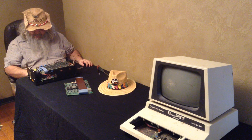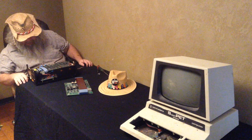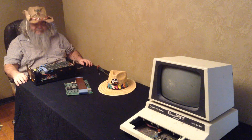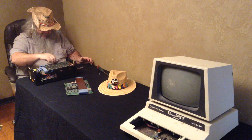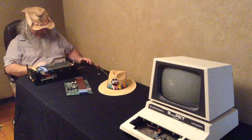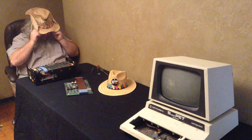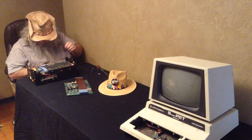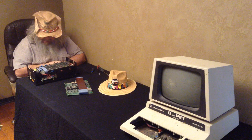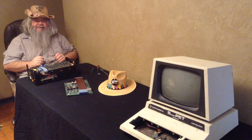Four screws, although it felt like there really should have been more. The IEEE connector in the back felt a little wonky. There are four legs here and when I undid the screws they came a little bit loose. As I glance over it, I think I have finally found - there is one jumper that I can see. And I think that is the secret jumper that tells the drive whether you're working with a seven and a half or a five megabyte drive.